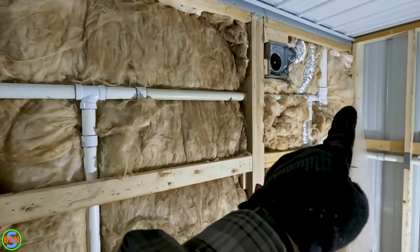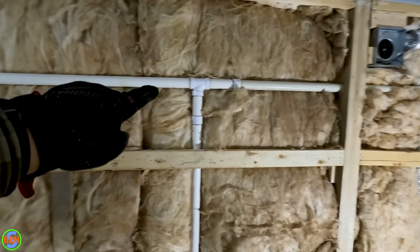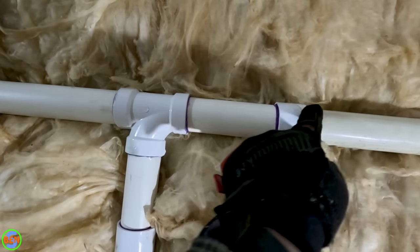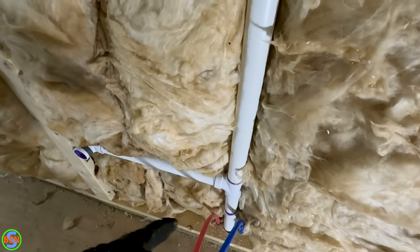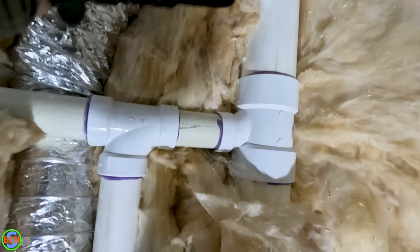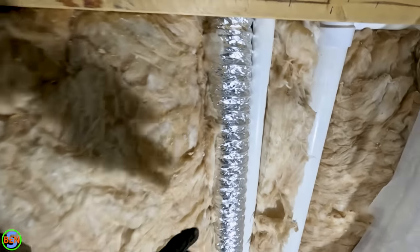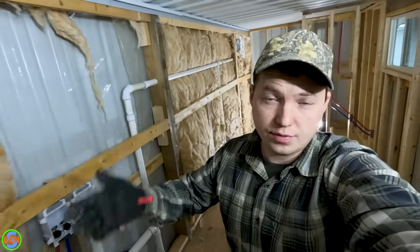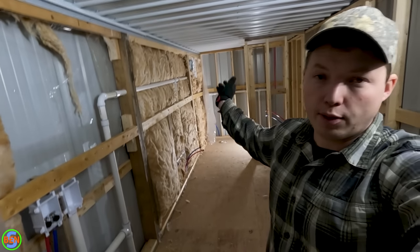One more thing with venting: you want to slope all of your vents back towards the fixture that they're serving. So this slopes back here and goes down, and you run your fittings accordingly. If you imagine water somehow got in here, it'd be going back down the drain. Going up into our main stack, the direction is pulling air from outside — and that's how air flows down to each fixture that is vented. Would it work if you flipped the direction the other way? Honestly yes, it would work just fine. But it's one of the ways you can help yourself know what's a drain and what's a vent based on the way the fittings are flowing back to the main stack.